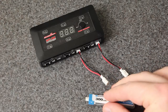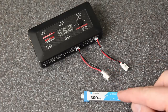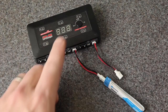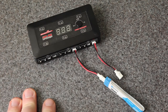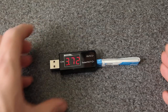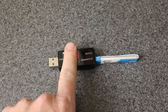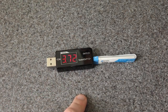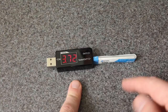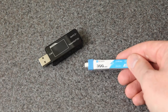How would you charge a battery with this connector? I think most people are going to use adapters — the drone comes with one, but you'll probably have to get more. The adapter lets you plug into a normal whoop charger; this one charges six at a time, which is pretty nice. The other option is BetaFPV's charger — it's small and doubles as a battery checker, but it only charges two at once and is powered from USB, so if you want to charge a lot of batteries you'll need several of these. This charger has no settings at all — it always charges to high voltage at a 1-amp rate, which is more than a 3C charging rate for this battery. That'll get them charged fast, but it's pretty aggressive.